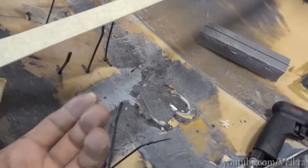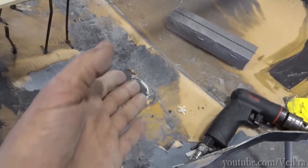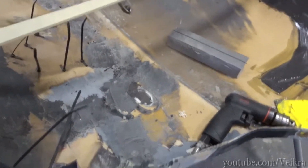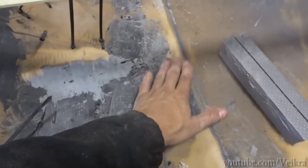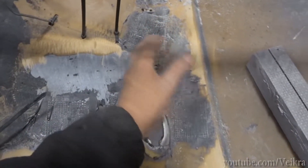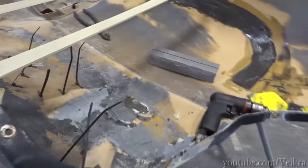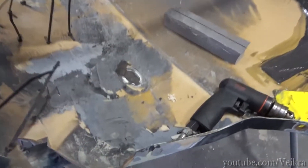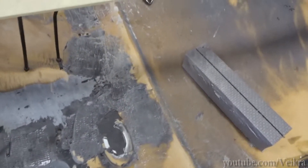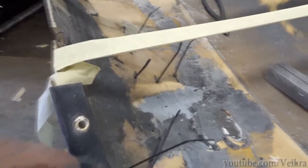One layer on each side should be plenty. Of course it's gonna be a pain because you'll be tempted to just repair the visible side, but you've got to do it on the other side too. Otherwise it's gonna crack elsewhere — where the glue and mesh are, there's a layer of glue and SMC, but where the crack is it's only glue, which creates a stress point and it won't last. The bad part is we've got to do it on the side you see when looking at the truck, so there's gonna be a lot of sculpting to make the mesh disappear. There'll be bondo, filler — there's a specific filler meant for that, and I'm itching to try it out.